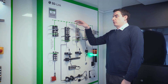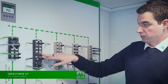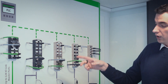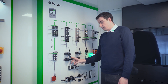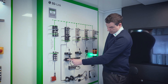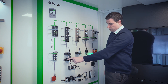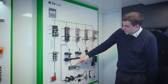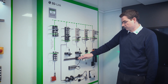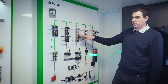We also have the IMPACT67, our compact range. With the IMPACT67 you get the communications, the power, and the IO-Link ports — up to a maximum of four, 2A type and 2B type. We are talking through an IO-Link coupler, and with that coupler you have great flexibility in having non-contact communication and power transmission. This hub here — which we can see flashing — can then be switched over to the MVK, and it's automatically aligned for IO communications.